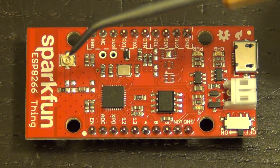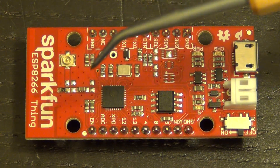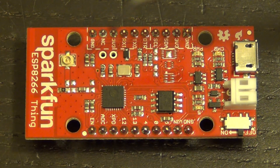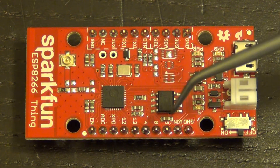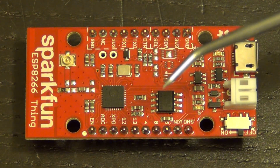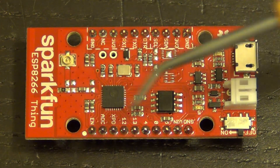You can also flip this resistor to the other side and have a micro-FL connector if you want an external antenna — in case you put this in a metal box or underground where reception is poor. All the IO ports are taken out over here. You can see it has I2C interfaces, an RS-232 interface, a single-port ADC, and IO ports which are all PWM enabled. This is all on one layer — there's nothing on the other side of the board. If you made a two-layer board, this would be tiny — a fraction of the size. It's made large because it's intended for prototyping.